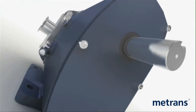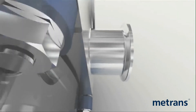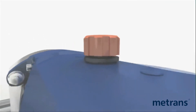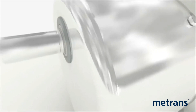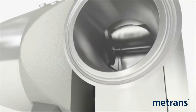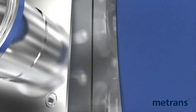The SRU is perfectly suited for both cleaning and sterilization in place. It is certified to EHEDG and 3A, and complies with many stringent standards and directives including CE, FDA, and ATEX. The SRU is also available in a wide range of materials, surface finishes, and with material traceability. Robust, flexible, and easy to maintain, the SRU is a member of the rotary lobe pump family which includes the Opti-lobe and SX. The Opti-lobe provides cost-effective reliability for general applications, while the SX is our premium product for ultra-sensitive and ultra-clean applications.